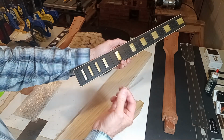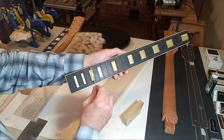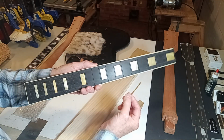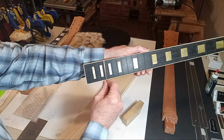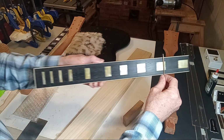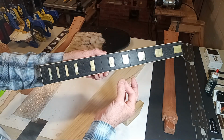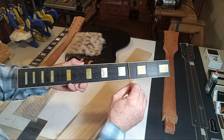Ah, shit, I got too short. Well, then I move down to the shorter location. Machine it, install it, machine it, install it. Get to the next one, and oh crap, I machined that one too far. Well, move it down. So if you start from the long end and work in this direction, then by the time you get down there and you've had one or two mistakes where you machined them a little too far, you just move it down here and snip off the ends.